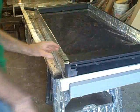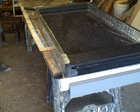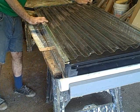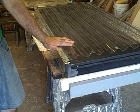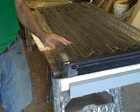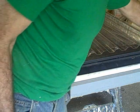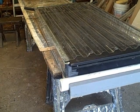One other thing we're missing is the glazing. This glazing piece is a little too short, but it'll give you the idea — it just fits in like this. The top of the glazing is flush with the top of the collector. On the top, we'll have some finished trim that goes right over here, and there'll be another piece of trim on this side so the water drips over the edge. That's the basic idea of the trickle-down collector. Thank you very much for your time.